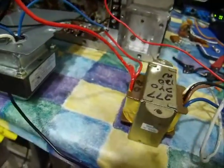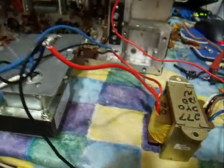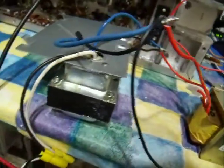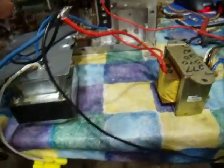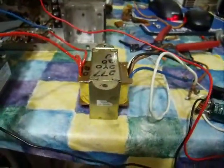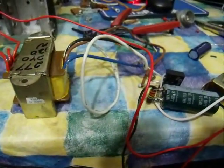I've got what used to be the secondary — secondary to secondary — so it comes in, steps 120 volts, plugs into the wall, comes out 12 volts to power the filaments, then it steps back up to the 240-volt winding. That gives me about 150 volts DC, and it requires 160, so it's perfect.